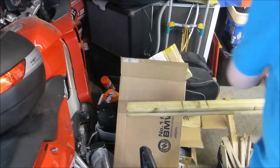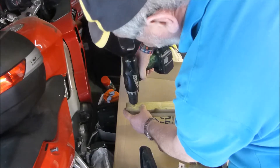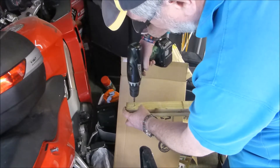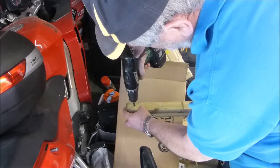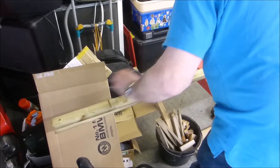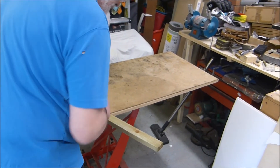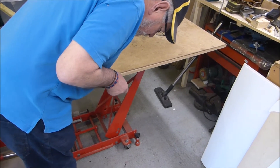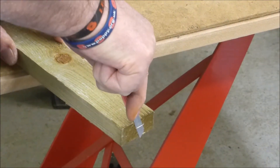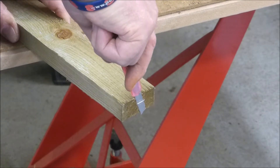As you can see here, we are drilling a clearance hole in the top piece, followed by a pilot hole in the bottom, which has then got a self-tapping wood screw fired through the gap, making sure not to tighten down the head of the screw so as to allow the top piece to move freely. The next thing we did was staple one of those snap-off box cutter type blades to the end, with just the smallest portion of the blade sticking out to actually score the piece of foam core.